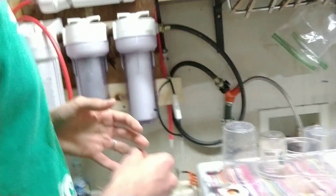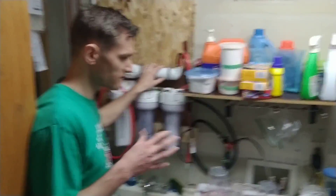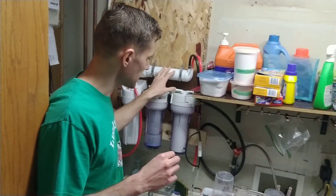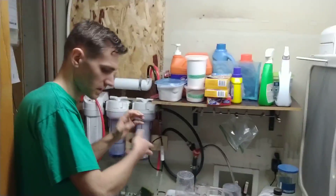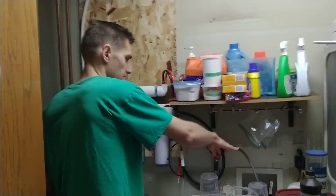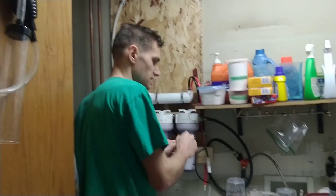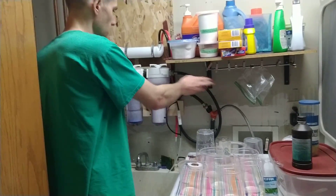The big question I had is that RO membranes work best at about 70 degrees — a little bit warmer than just the cold water which is what I've got right now. I had the idea — since this is right next to our washing machine, we've got cold and hot water right there — can I basically mix them using simple ball valves or a needle valve, so the washing machine keeps its supply but cold and hot also come together and get mixed to roughly the right temperature? As long as it doesn't get too hot I think it should be fine, and then go through the whole system.